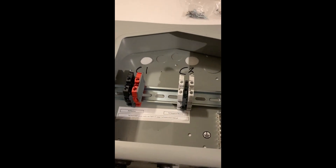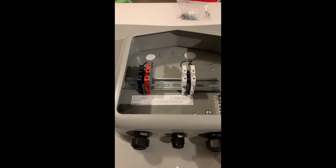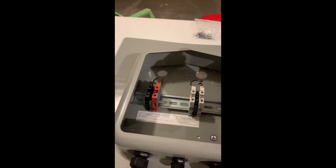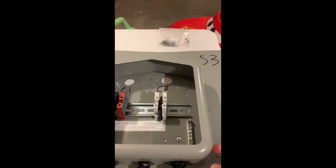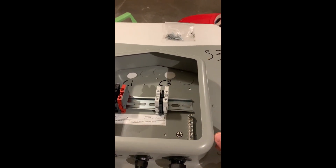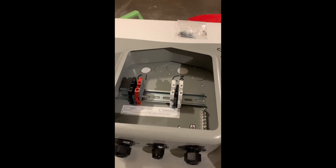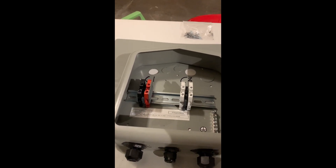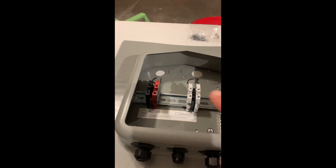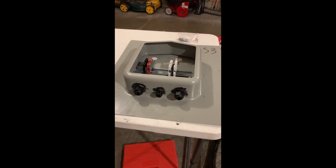You do not have to screw it into a truss or a rafter — you could if you wanted to, ideally. But most importantly, you need to line up the holes where you connect your conduit or wiring so they fall in between rafters. The last thing you want is a rafter right under one of those holes — that would be a bad day. You definitely don't want to be making a giant hole in your rafter. So the key thing is to line this up vertically and horizontally on your roof such that the holes where you run the wire do not fall on a rafter. We'll get things set up and go on the roof to show you how to get it installed.